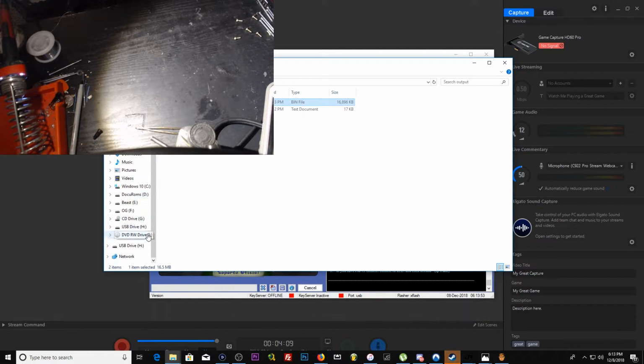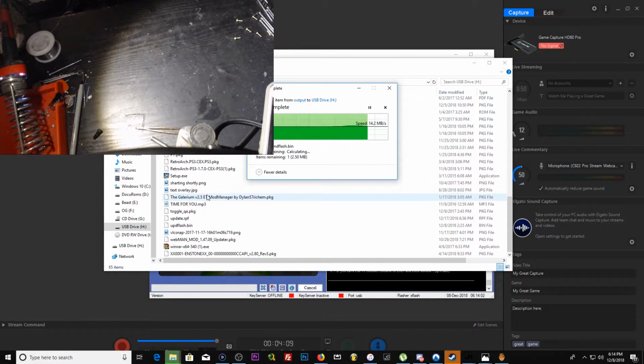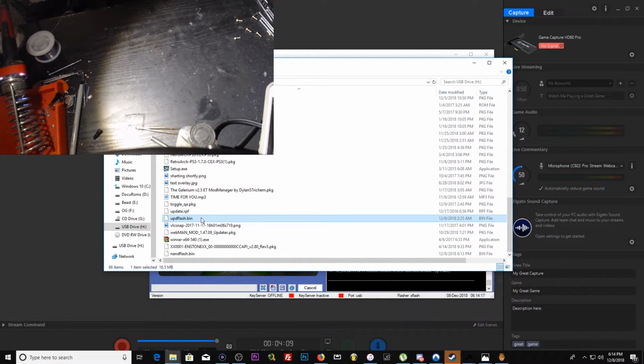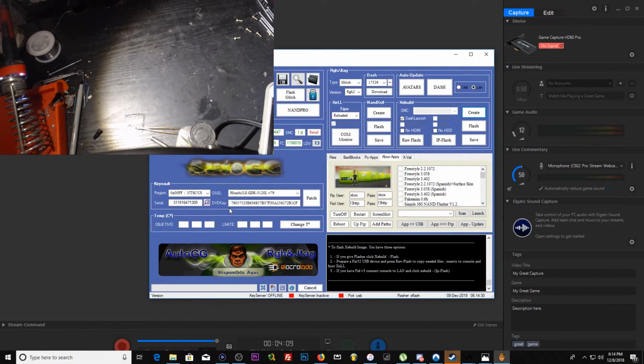Alright, copy this to the USB drive. There she is. I'm gonna paste this. Nand flash.bin. And we're gonna rename that to UPD flash.bin. That is what Xell is going to be looking for. Update flash. Okay.